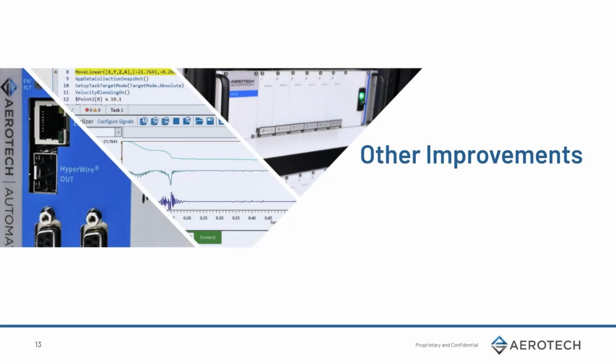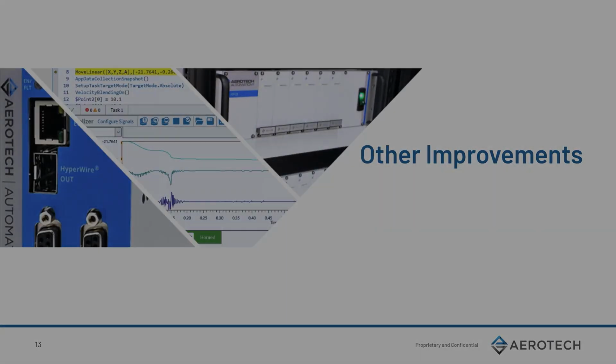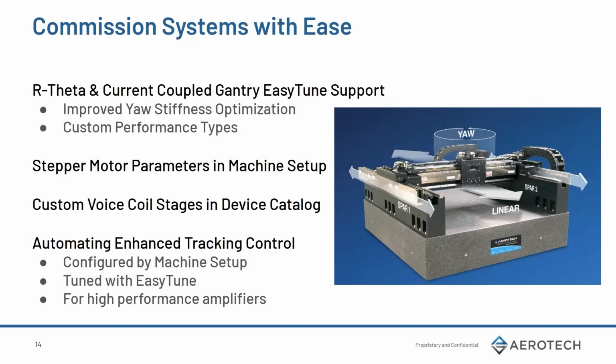I'd like to touch on a few other improvements that we've made that you may be interested in. We've made some improvements in Automation1 2.11, making it easier to set up and commission systems. First, we have official EasyTune support on gantries, both R-Theta and current coupled gantries. This allows you to tune an entire gantry with the click of one button.